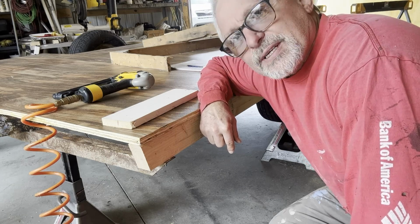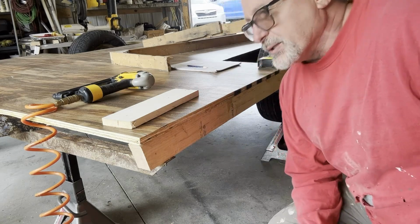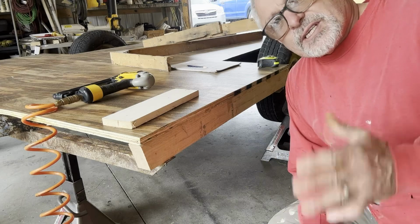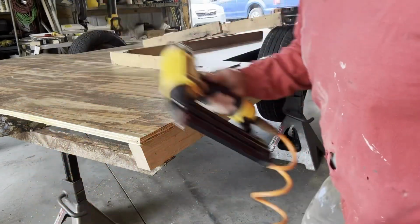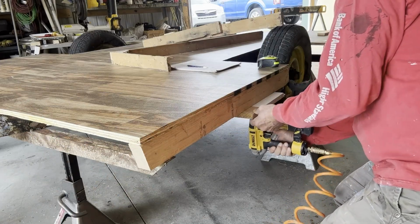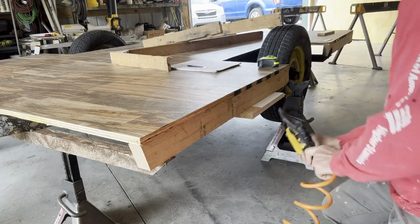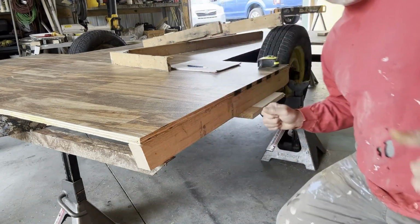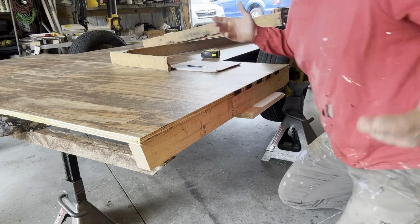And so sometimes you just don't have somebody to come out here and hold that up with you. I've been putting a jack down there, but it doesn't always get the exact height that I want. So he said he just takes this board like this, comes down here, and puts it to the frame. Whew, that doesn't feel all that good. Man, that's much better. And then he's gonna take and set the wall there. So I'm gonna try that.